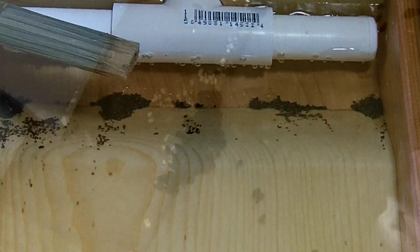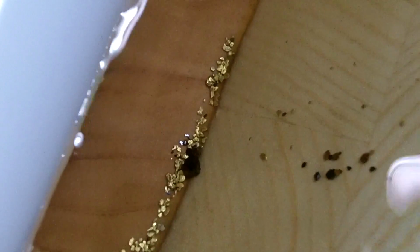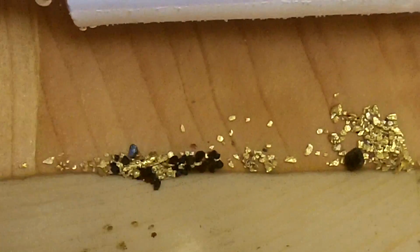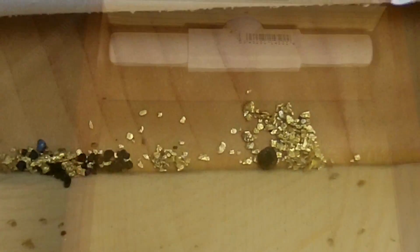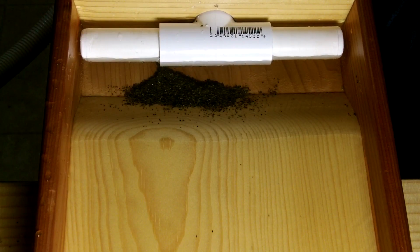And it had kind of an unusual result. It seems that the gold just dropped out down into the deep well, and the rest of the sand and material washed on down. Well, we ended up with nice clean gold with just a few of the larger pieces of black sand. So you want to clean out the black sand, I guess, ahead of time. What this was doing is acting as a fluid bed.